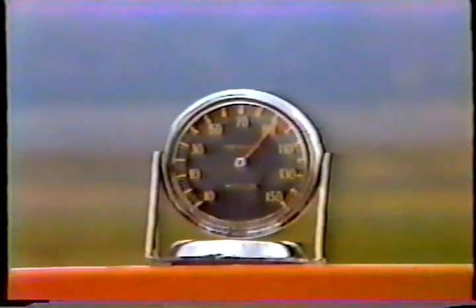One more thing before we get to the repair procedures. Although it's not your responsibility to schedule the work, be aware that the temperature that day should be above 45 degrees, and freezing conditions should not be expected within the next 3 days. Concrete won't set properly if it's too cold.